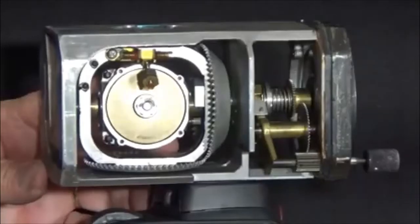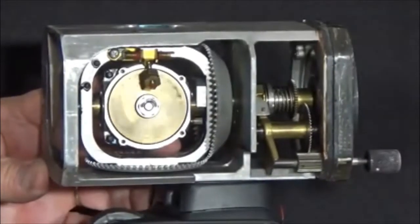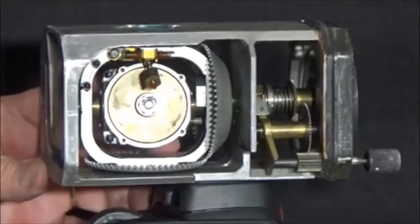This airflow exits through the other side of the housing where it is drawn out by the vacuum. This airflow is sufficient to get the gyro spinning over 12,000 rpm, creating a very rigid and stable platform.